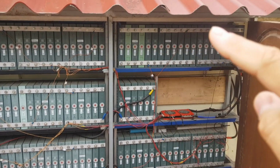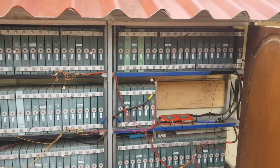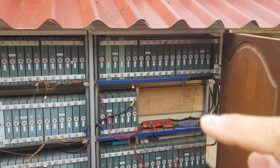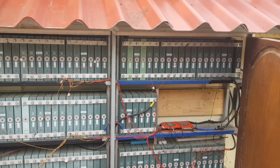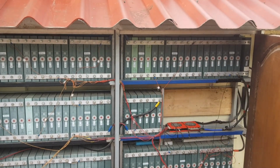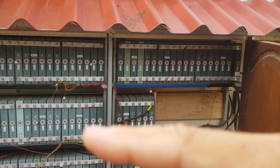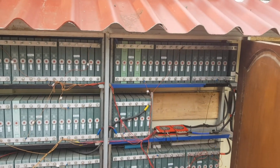we will put bus bars here, the main bus bars for the DC. So one cable will then go to the inverter. That one is a 70 square millimeter, and then there will be two breakers, one for each battery, and with the 35 square millimeters we will go from the batteries to the breakers and to the bus bars.